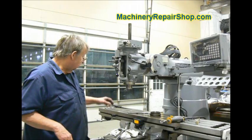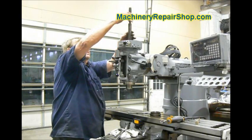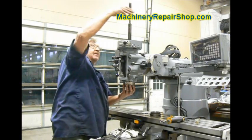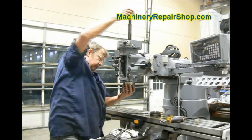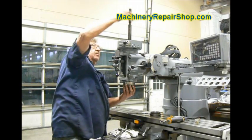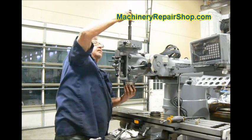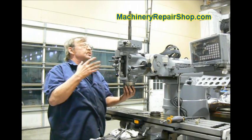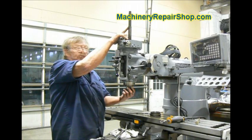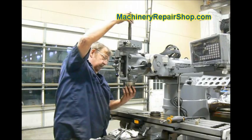That's the only thing that holds it again. The easiest way to get these things out is to stick the drawbar in there — it's a loose press fit. Stick the drawbar in there and hang it up, then pick the drawbar. You're not actually doing any damage to anything. This is far preferable to pounding on the end of the spindle shaft. If you do pound on it, put a piece of wood up there and don't wail on it — just pound enough to get the thing out.